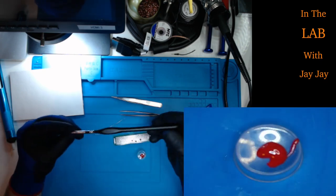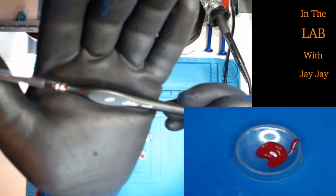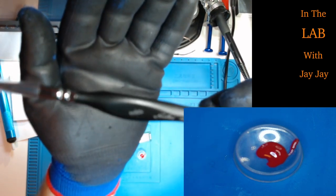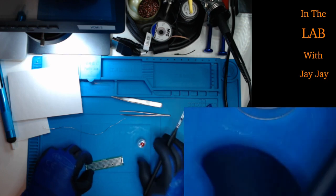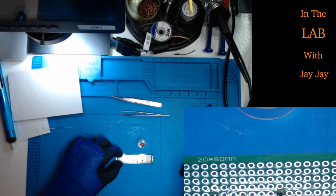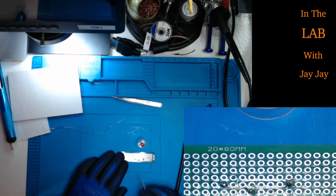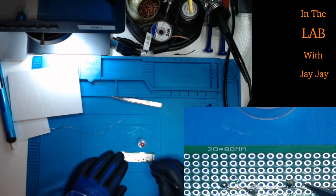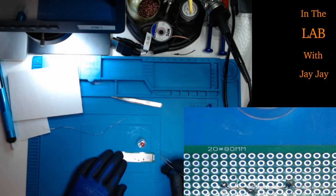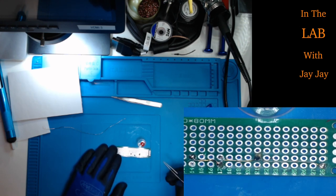And I've got this brush. It's a very fine tip brush. It's a 5/0. Can you see that? I don't know if you'll be able to see. I think the light's bad. Anyway, we're basically going to take it in, and we're just going to paint on our solder mask. We might give these guys just a little bit of a touch into the middle. They look pretty good to me. Can you see that? Looks fairly good to me.